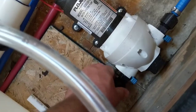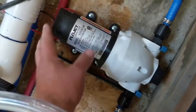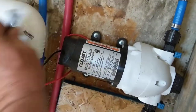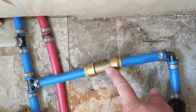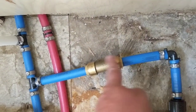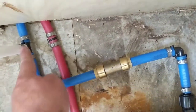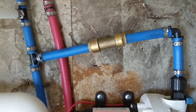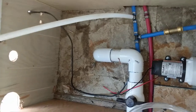Here is the out line. I used these fittings that spin when they're clamped so that I can replace this pump if I need to. Here's my pump — this is a DC pump. Make sure that you don't hook this to AC; it's got to be a DC system. This is a check valve, or a one-way valve. Water can pump through here and go out into my system, but when water comes in through my city water connection, it'll get stopped here so it won't be pushing through my pump and into my tank. That's really important to have — otherwise, when you're hooked to city water and it fills your tank, it's just going to keep filling and then leak all over the place.